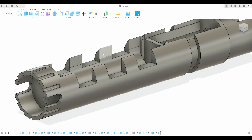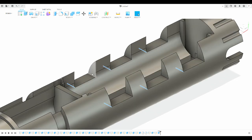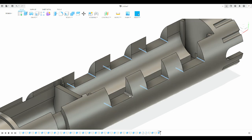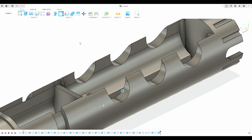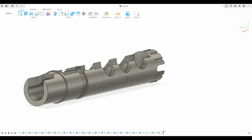Now I've created these little aesthetic pieces. I need to grab all of these corners and do the same thing we did in the speaker pod. Rotate it and hold down Shift. Remember these gaps are half an inch thick, so when we throw a fillet on it we want 0.25 — and that's what we did there, just like that.